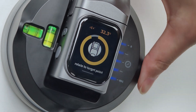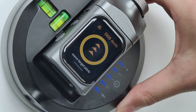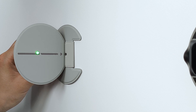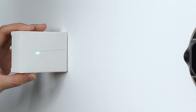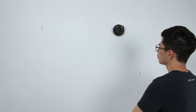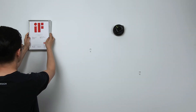Finding the Midpoint. Once you've confirmed both endpoints, follow the on-screen instructions to turn the M3O2 toward where you think the midpoint is. As the device gets closer to the center, line up the laser dot with a target — you can adjust the TargetMate or a homemade marker to get the alignment just right. The system will show an 'OK' on screen when the laser dot is exactly at the midpoint. To mark it, use the marker through the hole in the TargetMate, or if using a custom marker, line it up and mark right below the laser dot. And that's all — the center finder task is done.